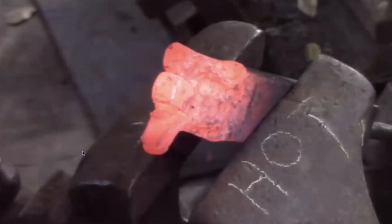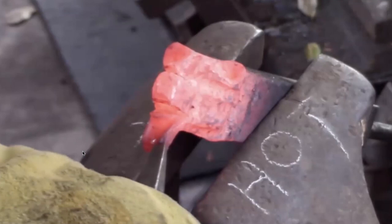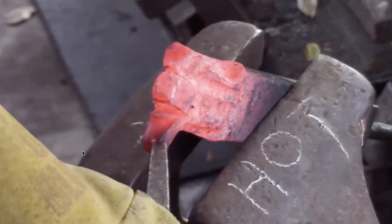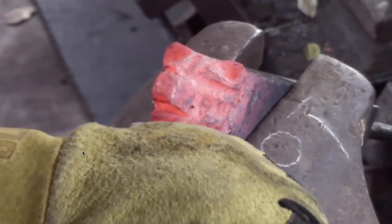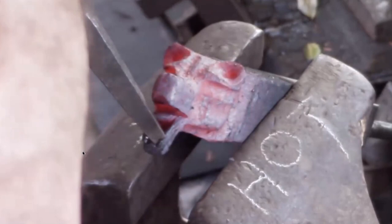There's my fulling swage, and I'm just twisting this backwards and forwards and treating it like a double-sided fuller, if you will. And I'm just trying to raise that material, shape my tooth as best I can. And I'm doing this at a lowish heat. Be aware of blue brittle. Don't work down into the black and give that a whack, because you'll end up needing a filling. So let's just take that down as low as you can into the heats, gently tapping that, working around the tooth.